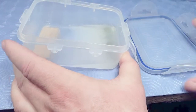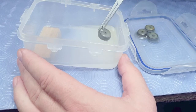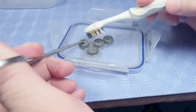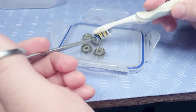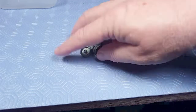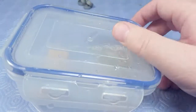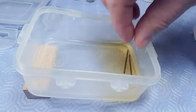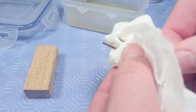Back to the wheels that have been soaking. The paint's still on there but it's been softened, so I just take that paint off. They look like they have a galvanized surface or something, but that's the way the thing arrived from the factory so it looks great. The axles are rusty — they've got kind of a copper plating on them — but to get the rust off I put them into Evapo-Rust. I didn't leave them overnight; they didn't need it, and I wiped off the rust in a few hours.